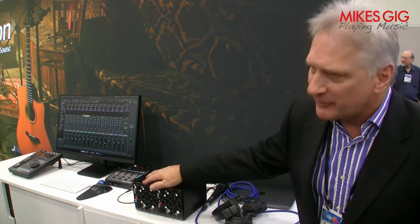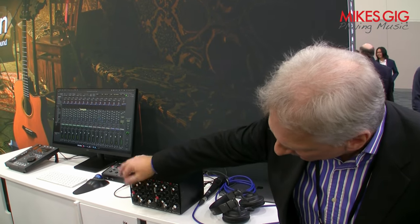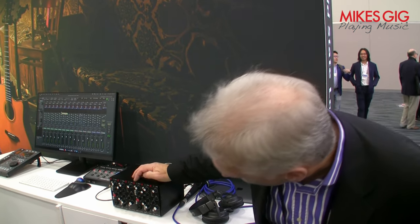Dave Harrison, who I worked with for many years, always told me that a low-pass filter is a luxury — so we didn't put one on this EQ. It has a high-pass filter: three-band EQ, variable Q on the mid band, proportional Q on the high and low bands, and a high-pass filter.